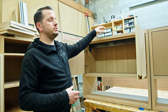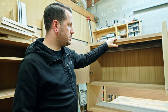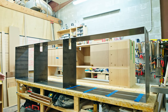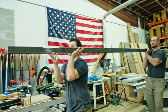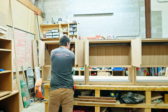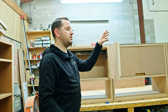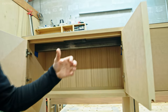The post coming down from the ceiling has an eight by eight plate on the bottom. That's going to have bolts that mount through our steel, through our one inch cabinet, and into this eight by eight plate that is attached to the beam. The idea is that these cabinets need to go in first, slide into this metal cased opening — all three of the cabinets. Then we need to install this beam, sliding it in from one end. Since our outside end is seen and finished, we can't put any holes or slots to slide that post through. If we welded this eight by eight plate onto our beam, we would have to slide all of that through, making the holes in all of these cabinets quite large. So we came up with a system where this plate is bolted to the beam after the beam is slid in.